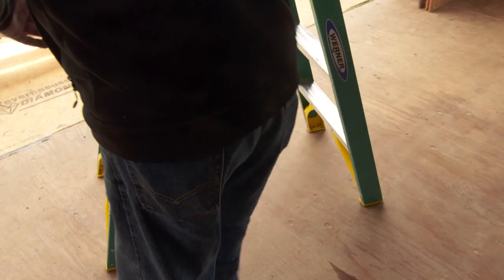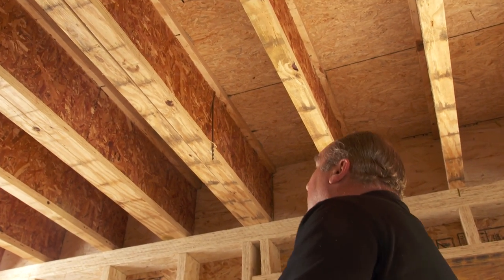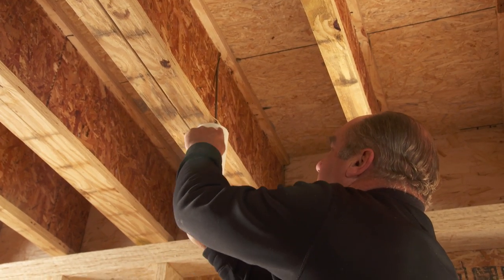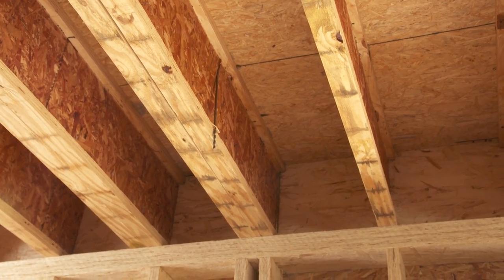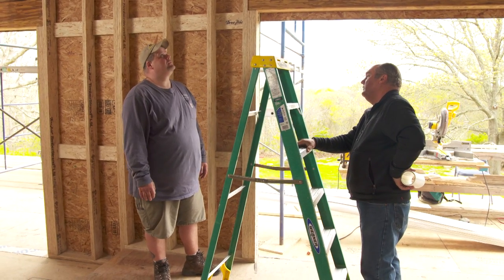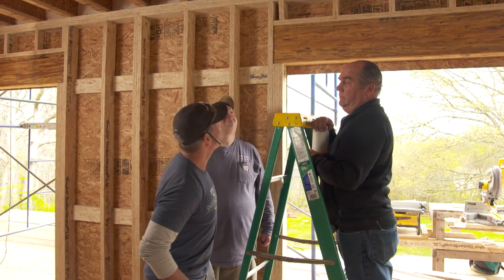Oh, yo — not good, of course. Josh, come on down. Look at this: if we try to put the toilet exactly where it's drawn, it comes exactly onto this double joist right here. The pipe would take up this much — we can't cut that structure out. So we're going to have to find a way to move this toilet one way or another. Unfortunately, a lot of times that does happen with framing in houses. So what we generally do is talk to the general contractor. We're right exactly on the joist there, Jeff. Never fails.